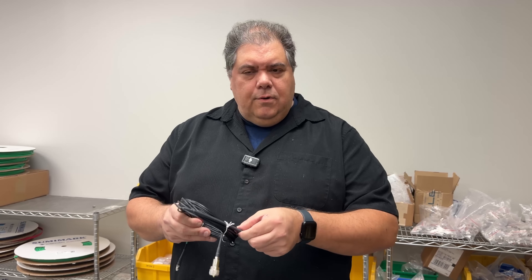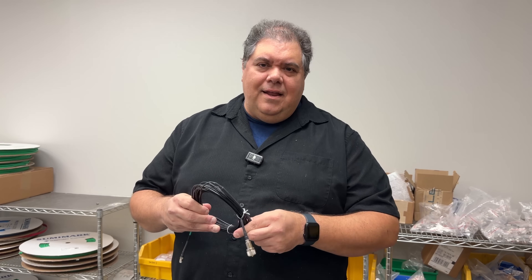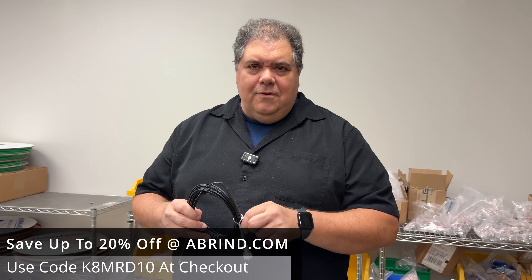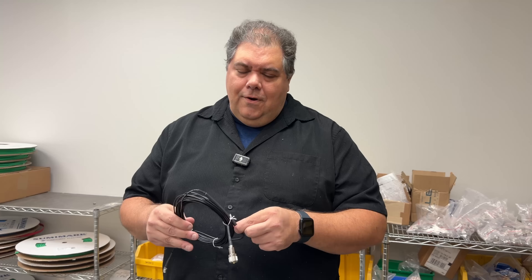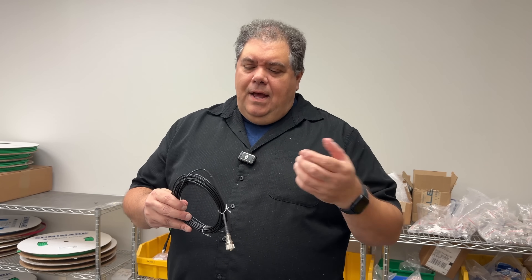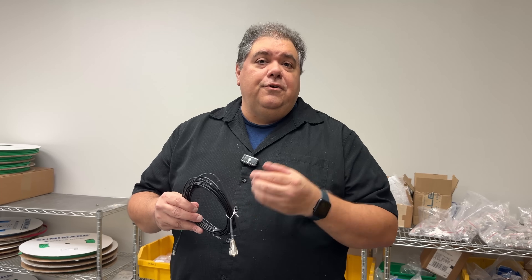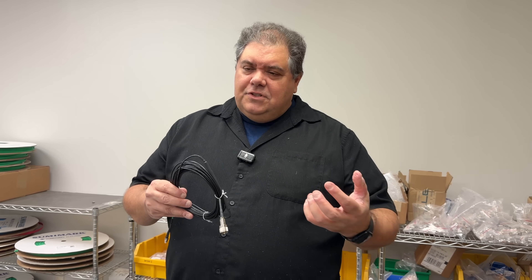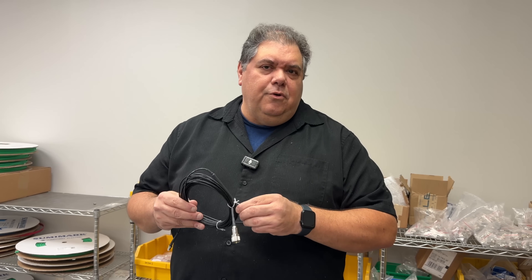So that's the FME. The ferrite assemblies can be installed on any cable you want. Three or five ferrites is usually more than enough for portable operations or working the home, but we do go up to seven. After that, we've capped out the performance of the ferrites compared to your receiver — we've isolated about 30 to 40 dB, and that's about as good as we can get for improving your noise floor.